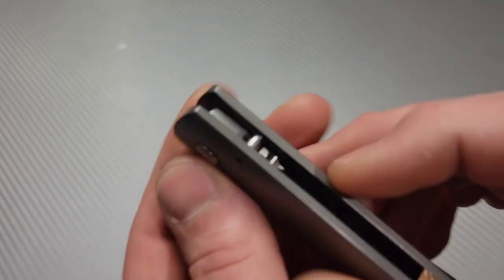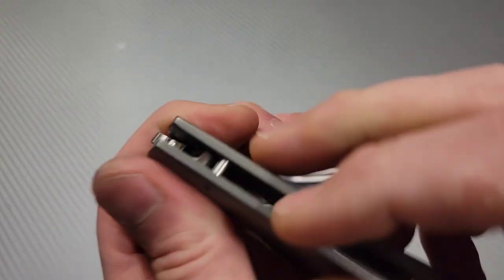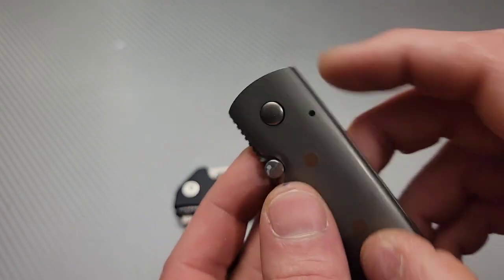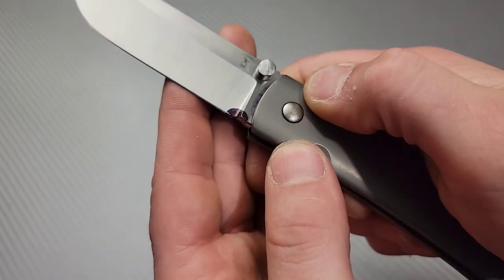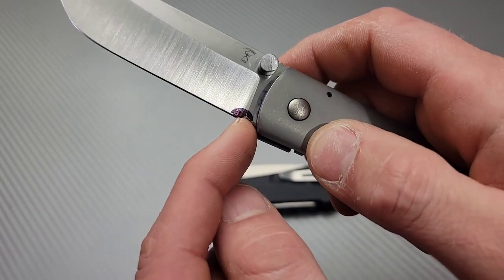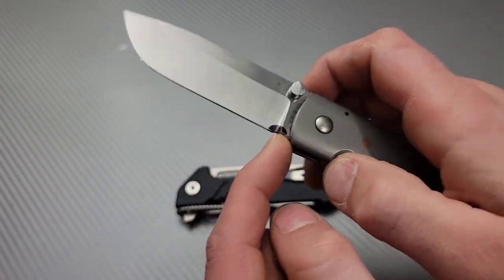If we look at this one, it actually does have a stop pin in the back. Do you see the stop pin? We can watch where it hits. This is very important because where it winds up hitting is out of the way — luckily it hits right down here. So we have plenty of room to cut in a choil up here. But if that stop pin hit here instead of right here, well then we'd have to be very careful.